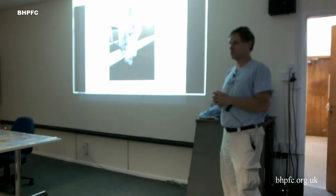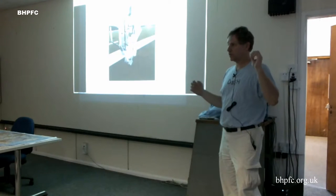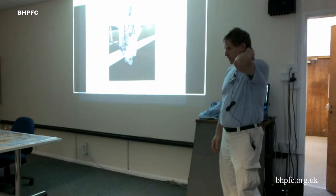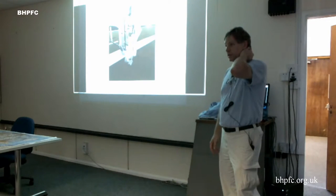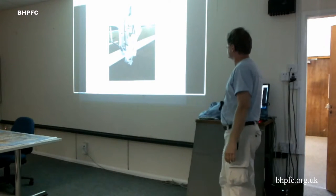My original sketches for Dash were an upright pilot position. I figured Gossamer Albatross did it, why can't we? But I was dissuaded by Bob Parks of the Daedalus team, who's been advising on Dash, that you really want to have the CG way down low so this doesn't happen. And we just happened to hit a muddy patch, and it's amazing how quick it went over, and I'll show you the video in a minute.